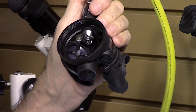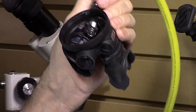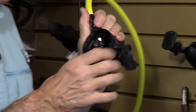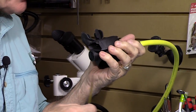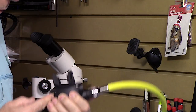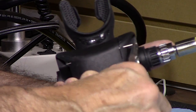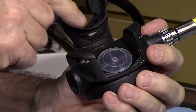Now, to solve a burping regulator — or more specifically a regulator that won't exhale, where you blow hard and it won't exhale — you have to look at the exhaust valve. To get to the exhaust valve you go to the exhaust side. This particular brand uses a pin — watch the pin on the far side, I just pushed it out, grab it and pull it out. Don't lose the pin. Then that cover comes off and there's your exhaust right there.